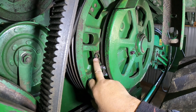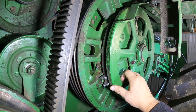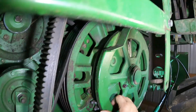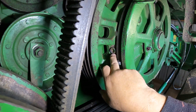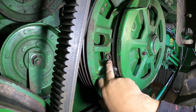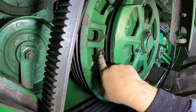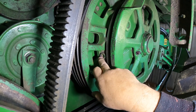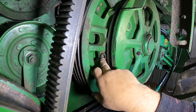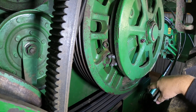Right here's a plug. Here's a picture of what it looks like — where it says top oil check. That arrow needs to be pointing straight up, and right now I've got that arrow pointing up here. So if I took this plug out, the oil level should be a quarter inch below that. Since I didn't know what was in there, I used a 3/8 drive ratchet to pull that out — treat it like a socket, short extension, ratchet pops that out. It recommends you use a four inch pipe nipple; I had a six inch handy so I put a six inch in there, got it out just a little further, tipped it down, let the oil start running out. I let it drain for two hours.